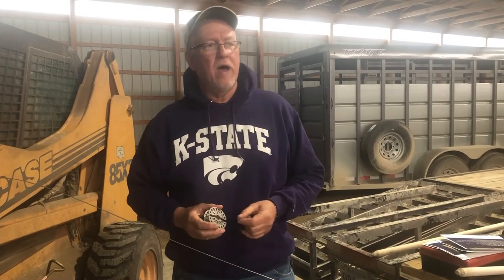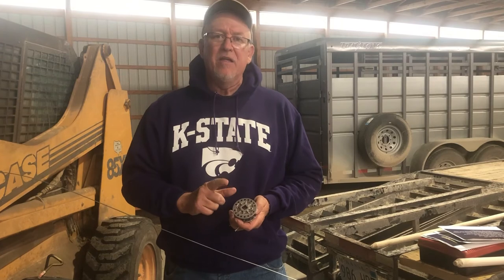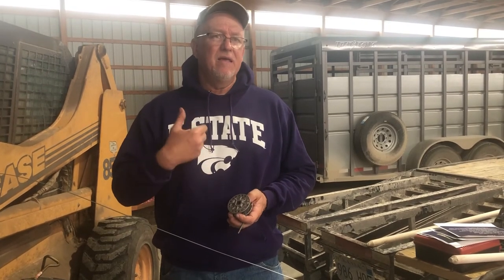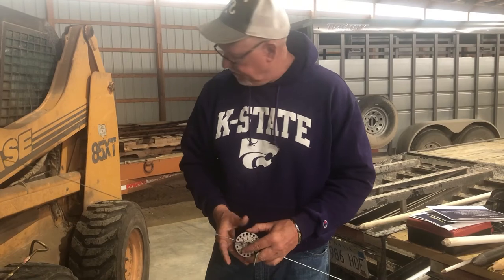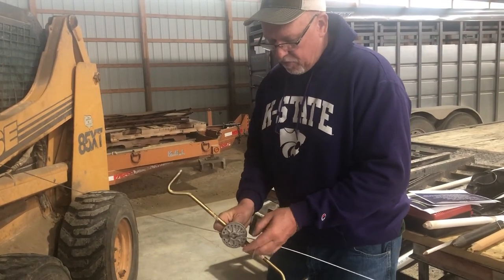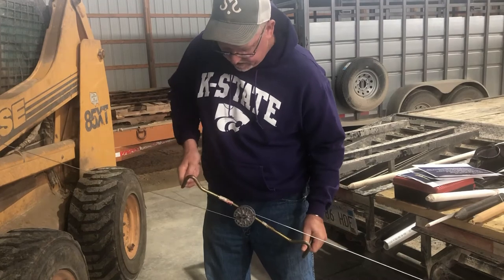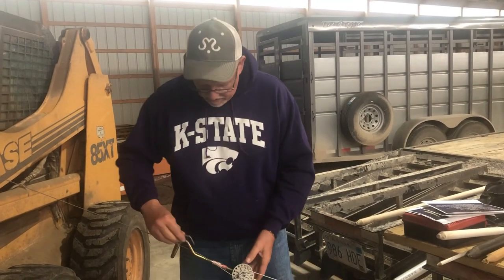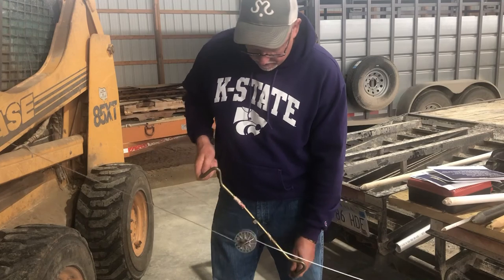Here we're going to show how you tighten the fence using a daisy wheel. Note that there is a half-inch square here — do not use a ratchet here because when you get tension on this, it could come back and knock your teeth out. Here's how you do it: put this on the fence — you see the slot here — put it on the fence, then grab your tool, put it into that area, then twist it like this and notice how it's getting tight. You can fairly safely do this without the pressure risk. Then all you have to do is slide your stop in and you've got your fence tight.